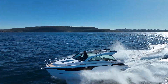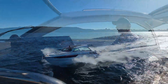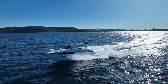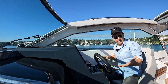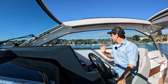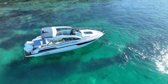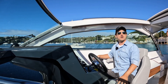Let's go into some protected waters to demonstrate how you might approach parking and anchoring this vessel, because those coming from commuter boats or walk-around decks will want to know whether you can manage a boat without direct access to the sides. We've come to a sheltered part of the harbour to simulate parking. First things first — let's try transverse thrust, one engine forward one in reverse.